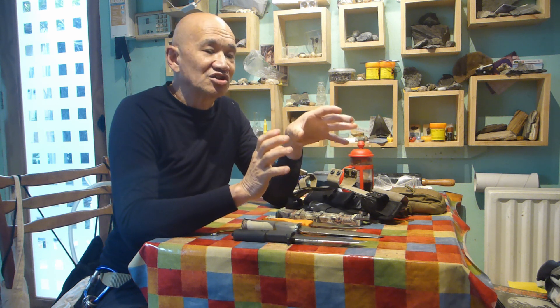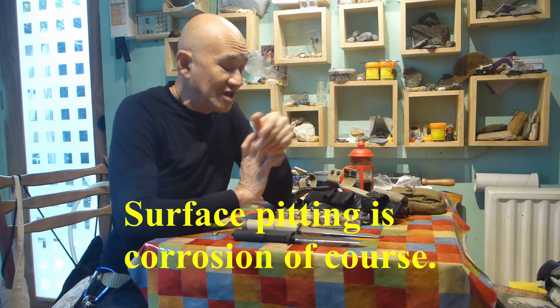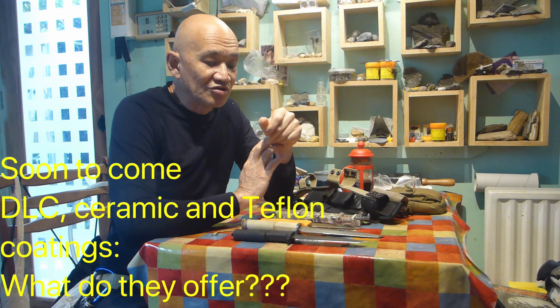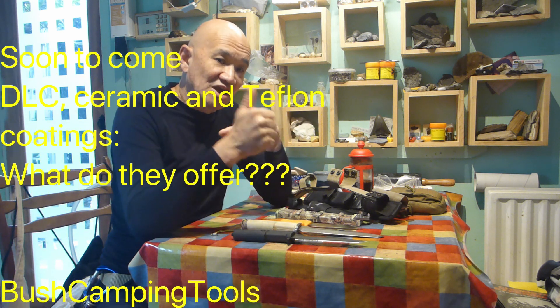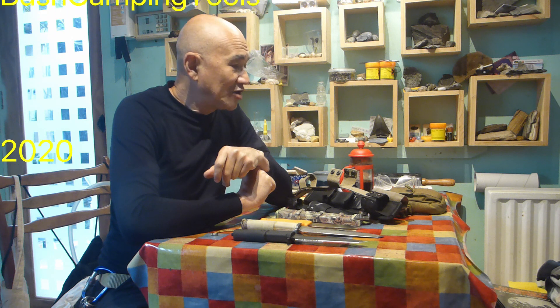So my take-home message is: the higher the hardness, the less chromium is available - all things being equal - for reacting with oxygen on a molecular level on the surface of the steel, and the greater the chance your knife will suffer from corrosion. I have an old ATS-34 Strider which is a real work knife and it does show some signs of corrosion and surface pitting - it's old and it gets used. That's all I had to say - I may do a part two as a follow-up. Bush Camping Tools here, thanks for watching, staying indoors with COVID-19.